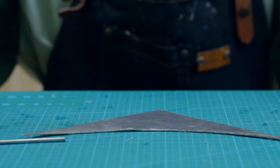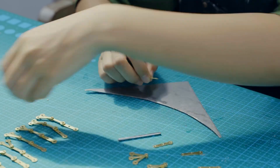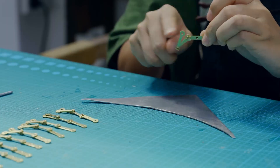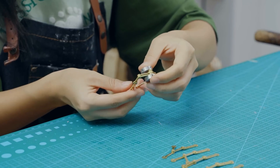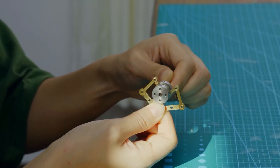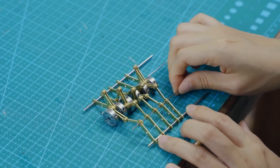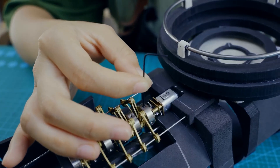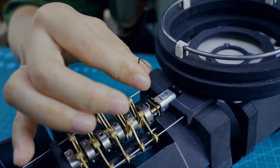The first part of the video focuses on how she made this mechanical element, and for as wild and mesmerizing as it looks, it's actually kind of simple. She's building a sort of camshaft using these offset collars, and then connecting the linkages so they all move as the main shaft rotates. All of the motion is driven by this geared DC motor. Maybe it's a little more steampunk than cyberpunk, but it's certainly got a great look and should be fairly easy to replicate.